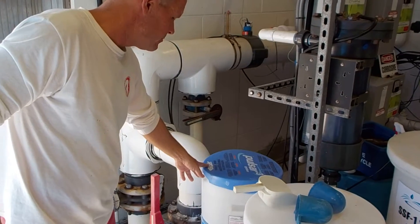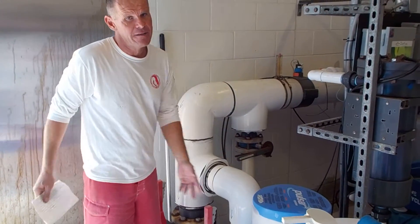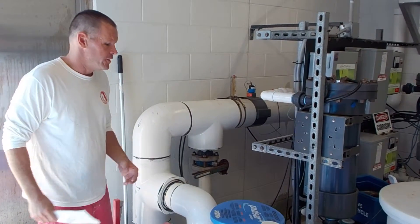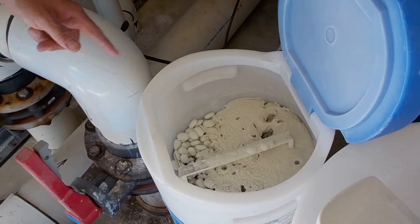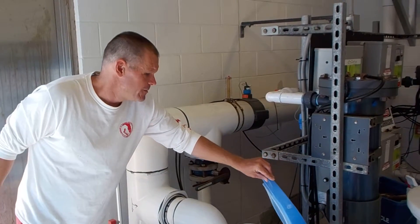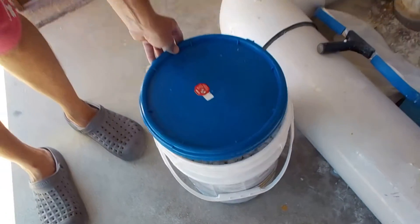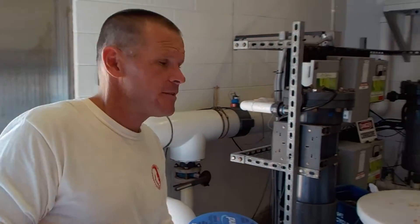This is our Pulsar tank — this is important. This is our secondary source of chlorine, which unfortunately we have to use every day, especially on a sunny day. UV radiation and intense sun is the number one factor that uses up chlorine. So you always want to make sure you open it and that there is something in it — this should never be empty. There are some pellets, and I also use some granulate, calcium hypochlorite, which is the same chemical with the same concentration just in a different form. This is what the pellets look like — be careful and use a mask, as the fumes of high-concentration chlorine are absolutely not good to inhale.